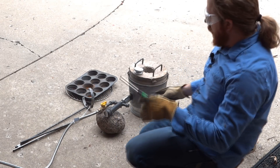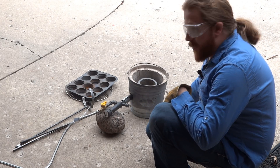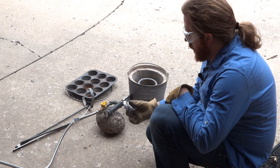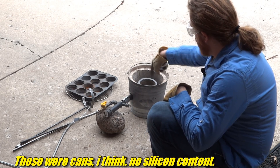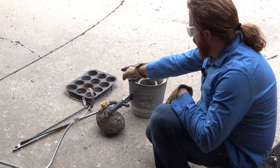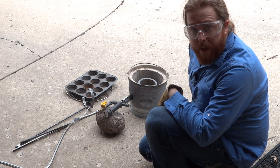Here's how it's going to work: I'm going to light this, get the mix going pretty well, then throw these in. These are two ingots — two smaller ones that are the non-cast aluminum — to form a pool first, and then we'll plunge the extrusions into that. Then we'll make ingots with that. I'll use some of the tools I just made. I've got a bucket of water behind me to quench them.